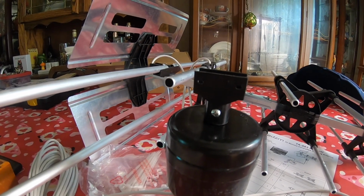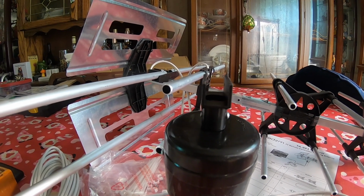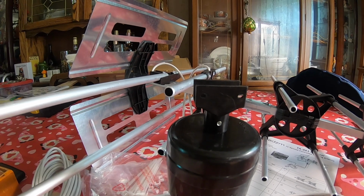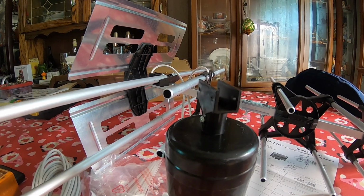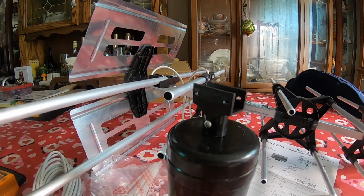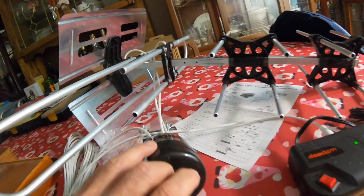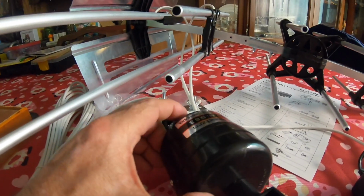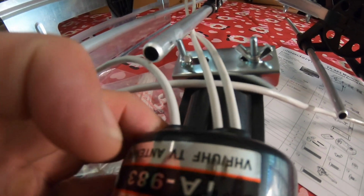We'll be having the antenna installed on a mast on the side of the house. Now we have a specialty mast for that, again from Home Depot. Bolts to the side of the house. It's got a jog in it to go around the gutters or the edge lip, and it puts it up above the roof so you can point it and swing it around. It swings 20 seconds to go a full circle one direction. It can do 3 full circuits in a minute, so that kind of gives you a feel for how fast it will rotate your antenna.